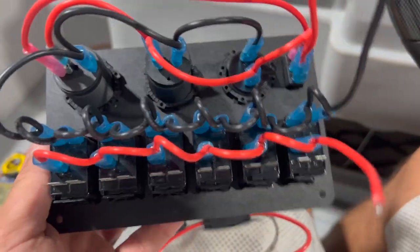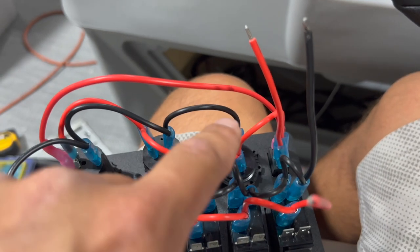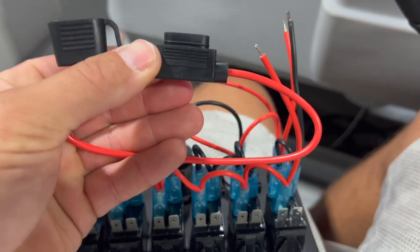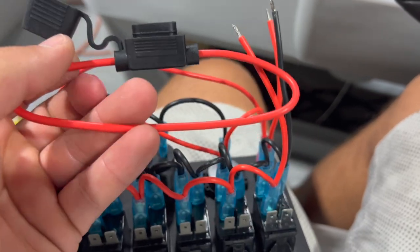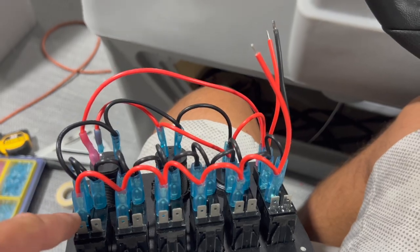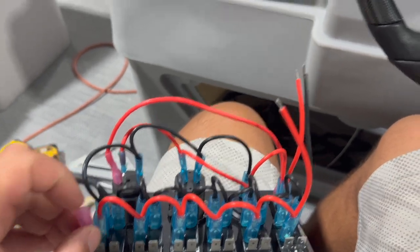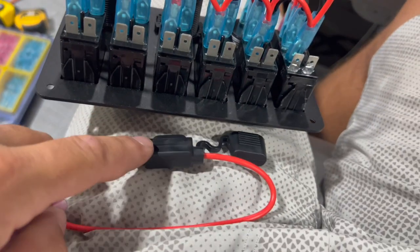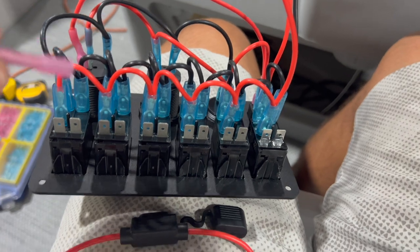Here's where we're at. I've got power going into that power-save switch that's going to power the voltage gauge, USB, and 12-volt. What I'm going to do now — I've got these inline fuse holders also off Amazon. They cap up so they're going to be watertight and resist corrosion. I'll put a 10-amp fuse in there, cut the wire, and splice in a spade terminal on one side. Then the fuse will run out and on the other end I'll do a heat-shrink butt splice, getting all those pigtails run off for all my accessories.